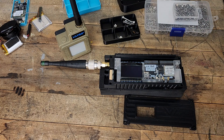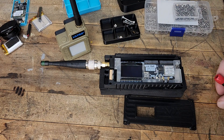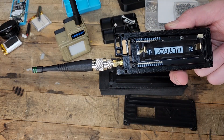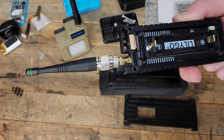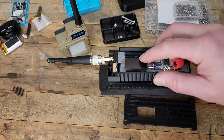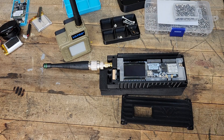Some other bonuses: it's got Bluetooth and Wi-Fi, just like the T-Beam. Same 18650 battery setup. You can do a mod and add a larger capacity battery — I think it's a 21700 — but you have to solder a different holder on and desolder the existing one. There is a 3D printed case that will adapt for that as well.